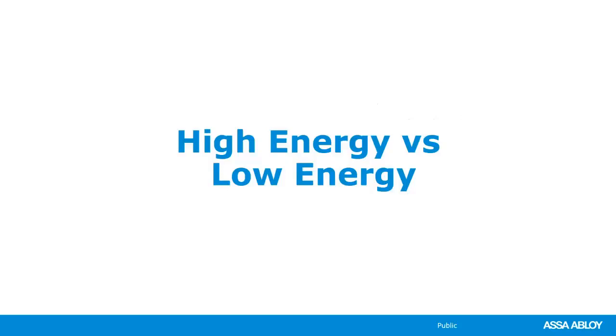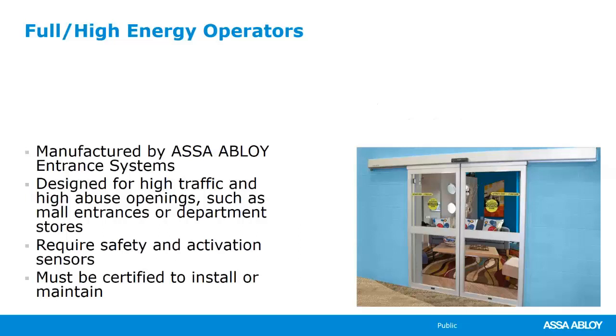So let's talk about low energy versus high energy. High energy is manufactured by ABLOY Entrance Systems, and these are designed for high use and high abuse applications. High energy doesn't have anything to do with the amount of electricity that we put into these operators, but they have to be installed by a certified installer. And usually the company that installs and sells these high energy operators are the ones that also have service contracts and maintain them for safety and compliance. So they have built-in safety sensors. They're, again, designed to be used all day long. People can walk up to these looking at their cell phone, and there's a motion sensor that opens up automatically, whereas a low energy operator is not allowed to be wired that way per code.